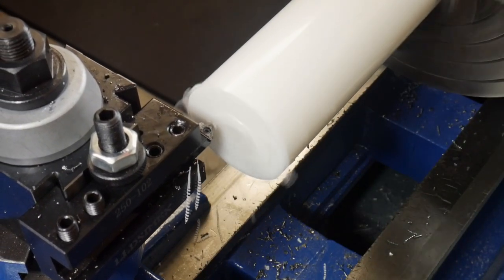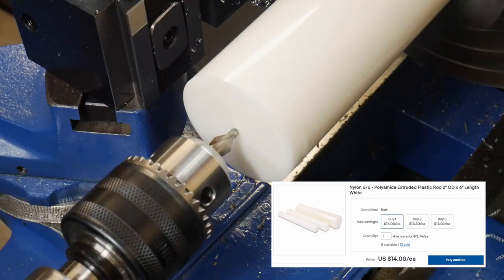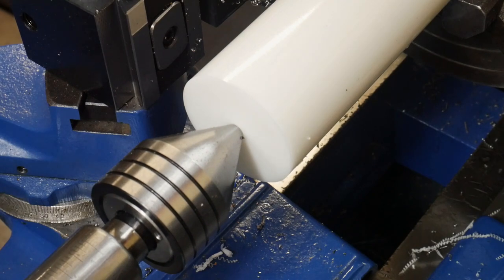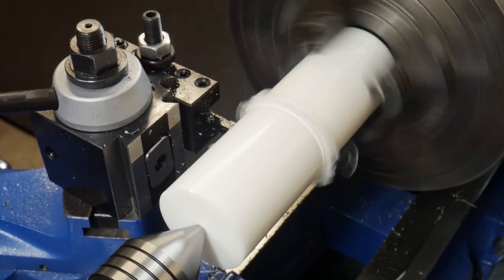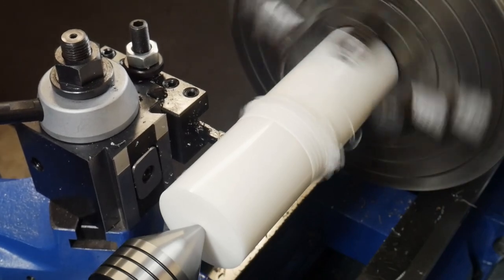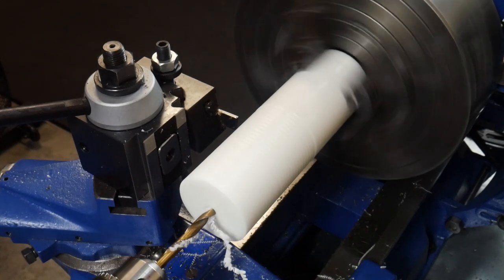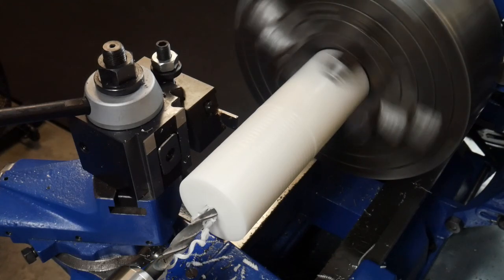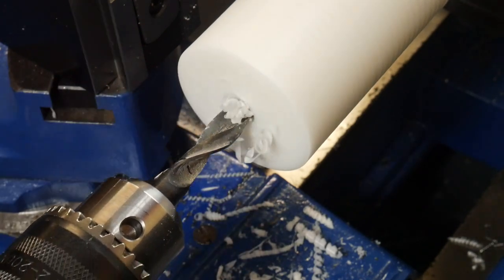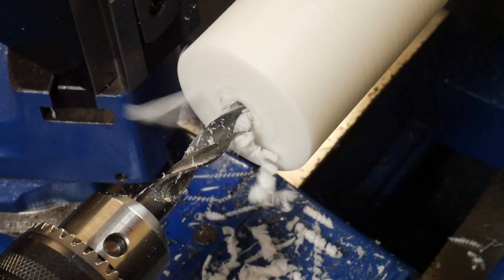Next we're cleaning up a piece of nylon — a two-inch diameter piece I bought off eBay, with a link in the description below. I faced off one end and then drilled a hole in the center so my live center can support the other end while I make sure it's concentric along the entire length. I only had to make one pass at about four and a half thousandths per revolution to get everything square, and it gave me a nice ribbed texture on the mallet which I think will be handy when using it with punches. We then drilled a three-eighths-inch hole through the center, just like our handle, to accept the all-thread later in the build.